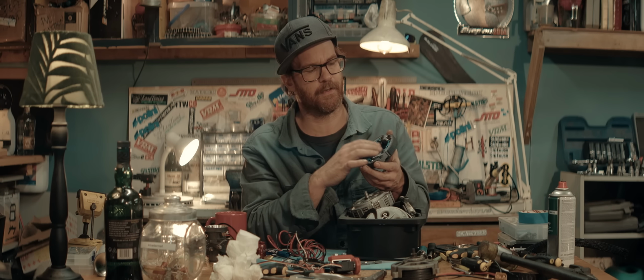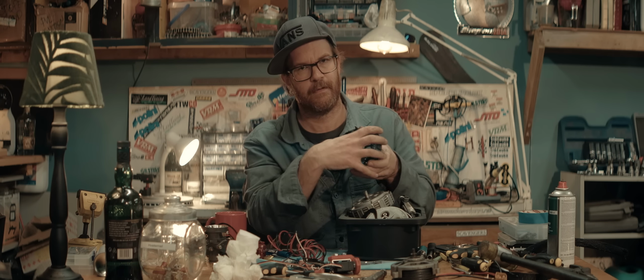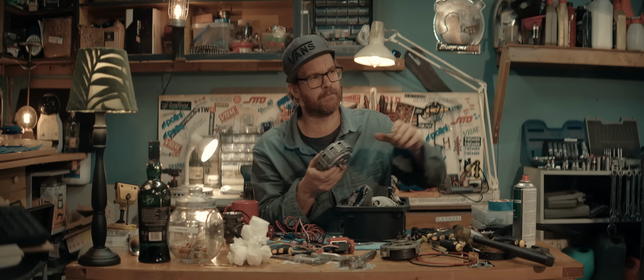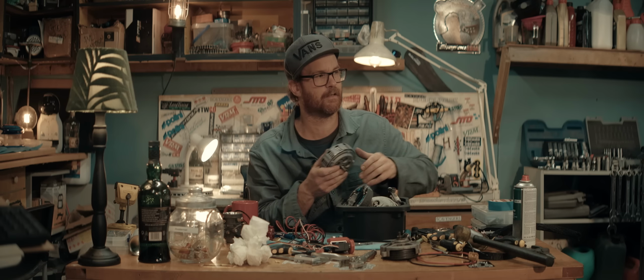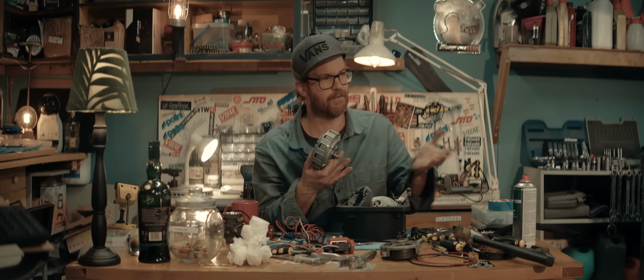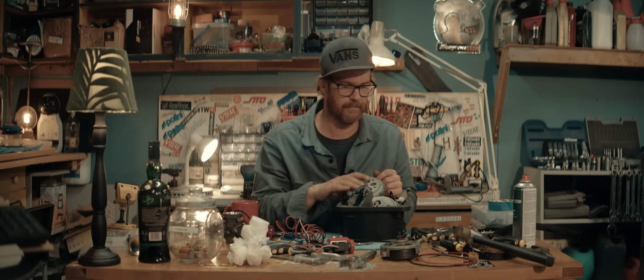Hard to get them adjusted where they grab early enough, but still apply enough pressure to the bell to grab properly. I could probably get this to work, but it would be much nicer with a manual clutch. Then I could also decouple the engine after a run, and decouple the engine if it seizes, which would be nice. And make it much easier to start. Start the engine, engage the clutch, then rev it up, and clutch it out like you would do in a bike.